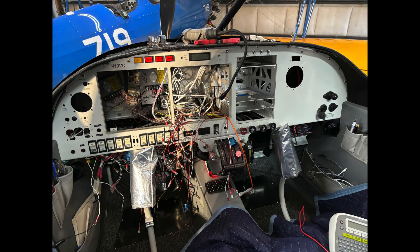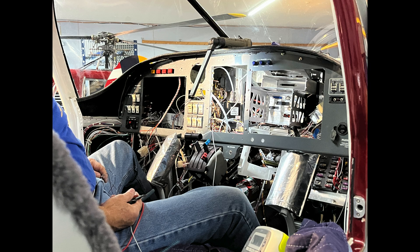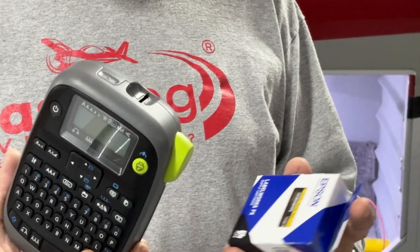Just in closing, a couple of things I learned. When you do something yourself the first time, you know exactly the wires you ran. Between then and now, there's been all kinds of avionics changes, test equipment put in and out, so there was a lot of wiring I was not happy with. It took probably the first half of the week just sorting out that wiring — getting rid of a whole bunch of it that's no longer used. We've got different equipment in the back now with ADAHRs that require different signal lines going to the front. So it was time to remove that wiring and take the time to actually label everything. There are new tools available for that — I made good use of this little Epson printer with heat shrink tube, so you can actually print labels for all your wires, making it easier next time to figure out what wires went where.